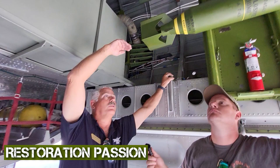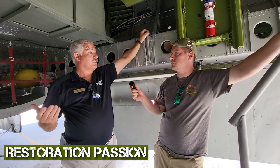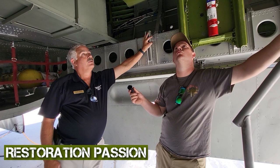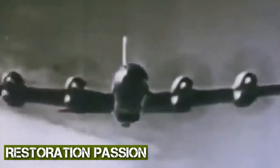Now, the U.S. did not have a shackle capable of carrying a 10,000-pound bomb, so we borrowed them from the British, because the British used the Grand Slam and Tall Boy bombs that were 12 and 14,000 pounds. The bombs were too big to roll in underneath the aircraft, so they were on a dolly that went down into a pit. The airplanes were pushed over the pit. The dolly was raised up, bringing the bomb into the bomb bay, mounted on the shackle, and then returned down.